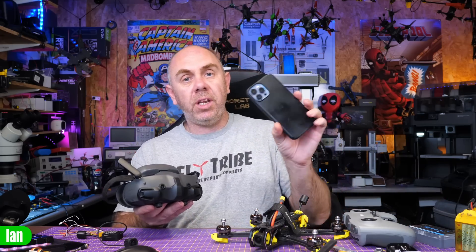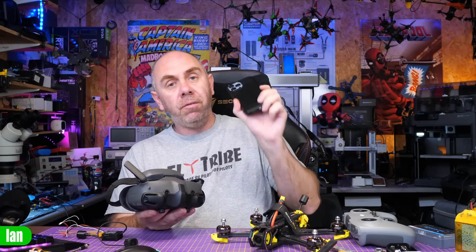The low power behavior is exactly the same as before. Low power mode still doesn't offer full RF output when turned off on the system. To get full RF power you do need to receive an arming command over MSP. What I can confirm works is all of the other Goggles 3 functionality — just like with the Avata 2, you can wirelessly stream your video from your goggles to your smartphone via the DJI Fly app when used with the O3 air unit.